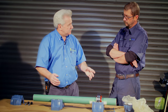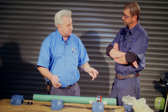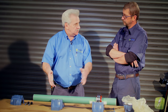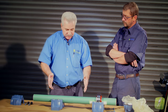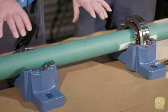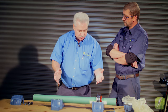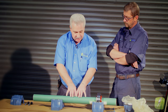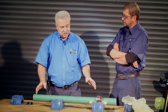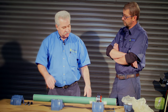So when we go out to balance a fan — and it's a big fan — and they say they've changed the pillow blocks, I would be concerned and ask: what's in there? Can you show me what you took out and the arrangement? Because if it has two locking rings clamped to shafts on both ends, it may not fail in a week, but in a month or two, if it's hot enough, it's going to expand until it takes out both bearings. Then you could have a major catastrophe with the fan itself banging around inside the unit.